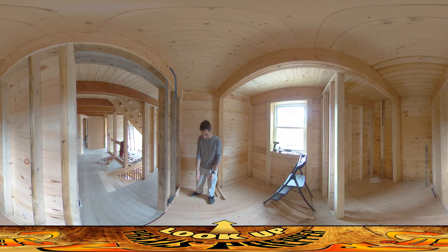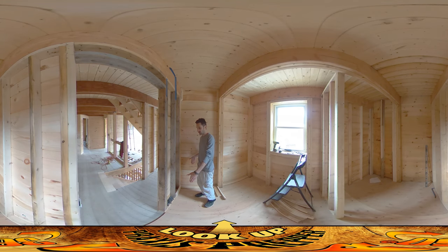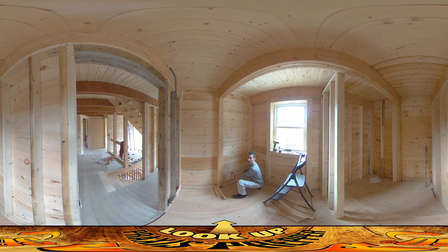I thought I had written it down on the floor here. I've got some notes written down — I had written the depth of the clothes washer, with the idea that you might want to put a dryer up on top of it. I wrote that information but forgot to put the actual width. I'm trying to figure out exactly where this wall is going to be. There'll be a washer at the bottom, and then on the other side is a sink. The plumbing comes from the washing machine, joins in with the sink, water goes down there, and a vent goes up and flies out that way.